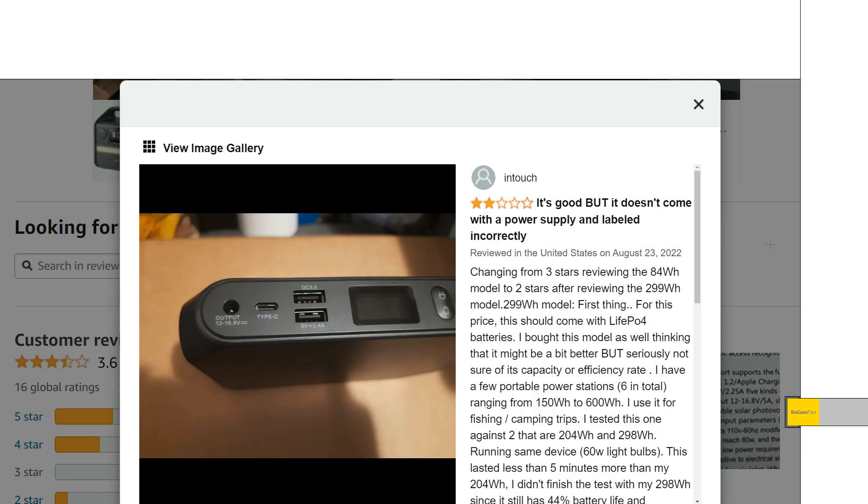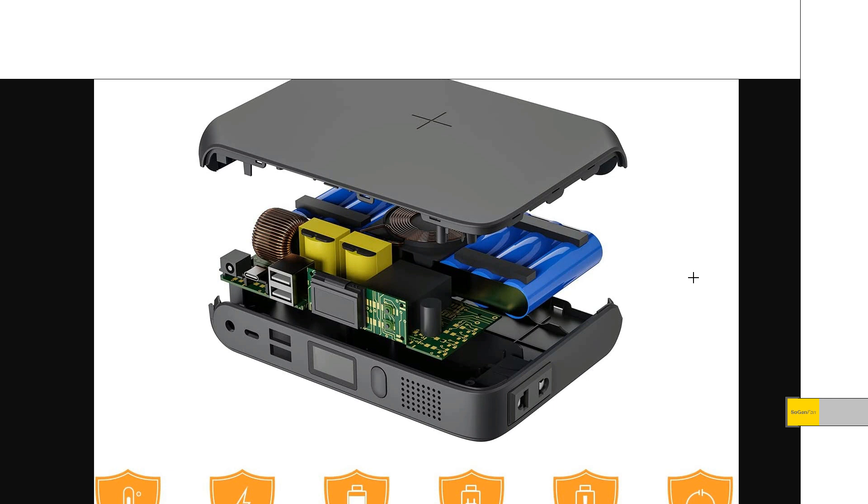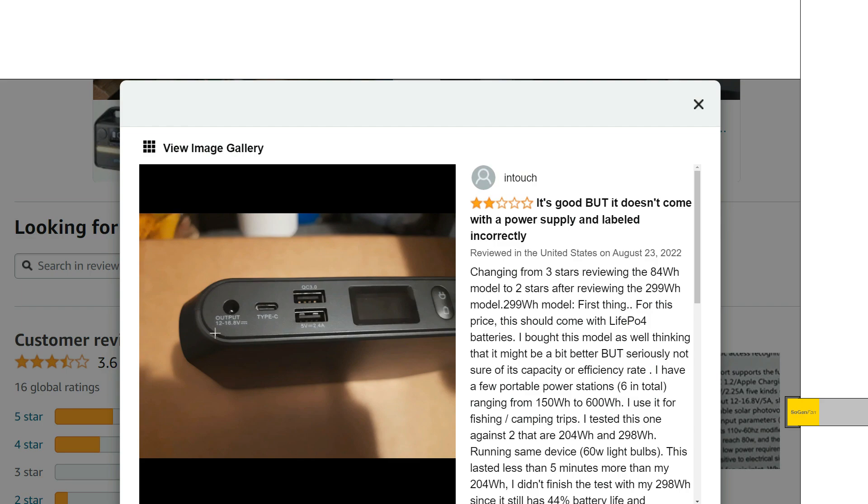The really interesting thing with this is the 12 volt outlet. Thanks to a reviewer who provided this image — the thing to note is this is a standard 5521 connector for the 12 volt outlet, but the output actually goes from 12 to 16.8 volts. They're using standard 18650 lithium ion cells — no surprise in a small unit like this, you're not going to have LFP batteries. They're using a total of eight cells with four in series. You can see six of them, and there's two more under the wireless charger. With four in series, you get that voltage range: 12 volts is completely dead at 0%, and 16.8 volts is 100% fully charged. A lot of cheap small power stations don't have regulated output, so you need to be aware of this.